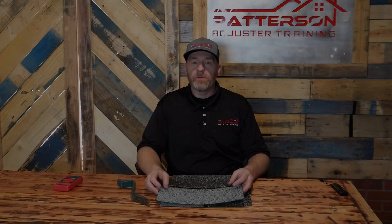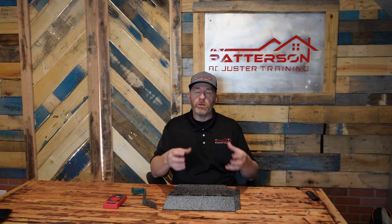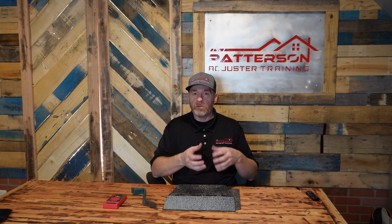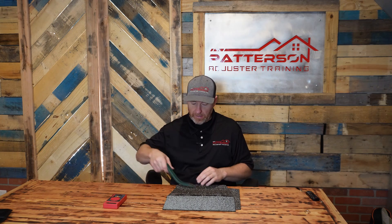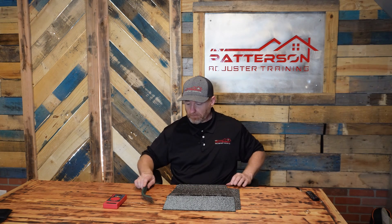As you can see, those ridge shingles are not repairable. And so there is no brittleness gauge. The repairability gauge is having a contractor make a good faith effort going out there and actually doing a repair on that shingle — whether it be hip shingles, ridge shingles, field shingles, whatever. They need to get in there with their tools, get those nails out, and slide that shingle out and put the new one in.